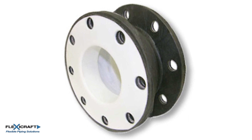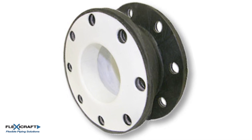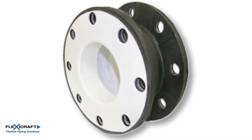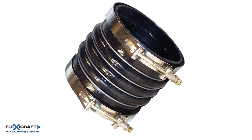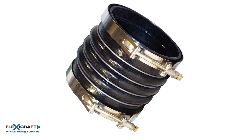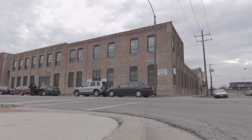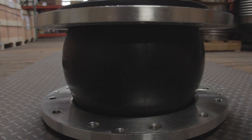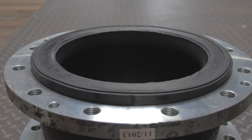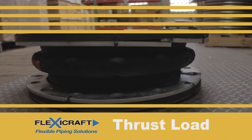Both main styles are nearly always connected with flanges, but it's possible to sleeve on a rubber expansion joint over a pipe using clamps. For example, our model SLV coupling is available up to 12-inch diameters, with the inner diameters sized to go over steel and PVC pipe. In a moment, we'll go over additional application points involving optional tie rods. But first, Paul Berg from FlexiCraft has an overview of the critical and often misunderstood concept of thrust load that applies to all pressurized flexible elements. This load is key to understanding the use of tie rods.